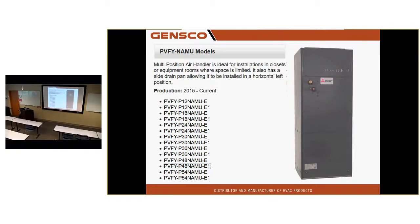Most air handlers are shaped like a horseshoe with a panel in the front. That is 4 separate panels. If you have a small hole and your coil can come out of the unit and fit through the hole, so will the rest of the unit. Because it can be completely disassembled by 2 guys with a drill, stuck through a hole in the attic, put back together in 15 minutes. It won't be looking the same after all. Well, I can't control that. They overbuilt this thing so sadly. Even around the plenum connection at the top, there's half-inch high-density foam insulation.